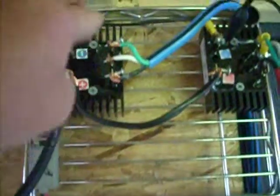Yeah, my setup. So there. Oh, you see, this little grate thing spaces my rectifiers off the wall about an inch. And I notice on the back side of these rectifiers, the cooling fins run up and down. And so that way it'll draft better and cool better.